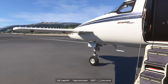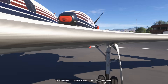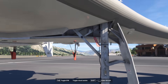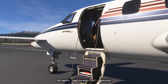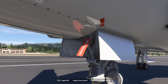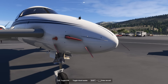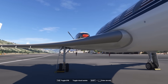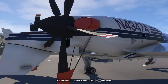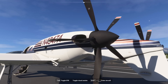Back on the ground, let's take a look at some of the walk-around features. In addition to engine covers and wheel chocks, the most important pre-flight items on this aircraft are the gear downlock pins. These pins prevent the gear from inadvertently retracting when the aircraft is on the ground and the hydraulic landing gear system is depressurized. These pins are stowed in the cockpit storage area so they can always be accounted for from the pilot's seat. If they're not removed before flight, the gear will not retract. The remove-before-flight streamers on these pins and covers also blow with the wind, which can help you position the aircraft for a cool engine start by facing into the wind. If the pitot-static covers are left on, you can expect false readings on the instrumentation. But leaving the engine covers installed can be catastrophic — when starting the engines, suspiciously low gas generator RPM should be your hint that the covers have been left installed, and not to introduce fuel into the engine.